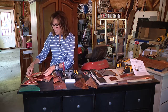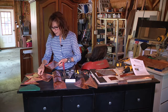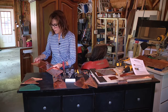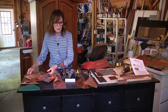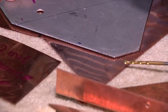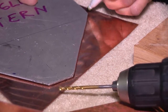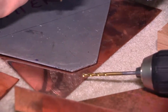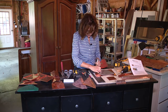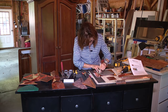What we're going to do is take just the flat pieces of copper, cut them out into a shingle. The shingles are interlocking, so some of the edges are bent over, some of the edges are bent under, but when they go on the roof, they're going to go like that, and it looks really, really cool. Our main piece is just the main shingle right here, and I'm going to trace that onto a piece of the scrap copper. Now what you want to use for this is roofing copper, and that is known as 22 mil or 16 ounce — it's the same thing — and that's the thickness of copper you need for a project like this. After I have this all traced around, I want to make sure my lines are good.